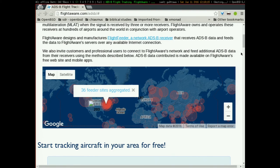One thing I didn't mention, I just want to throw out, just because the device is limited, like the RTL-SDR, the way the HackRF and the BladeRF actually look at 20 megahertz simultaneously is it's just switching through the bands at microsecond speed. Now, obviously, the RTL-SDR can't do microsecond speed, but you could tune across multiple bands as fast as the USB bus can respond.